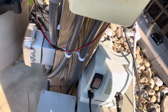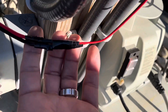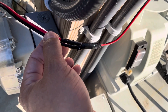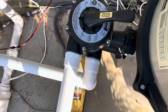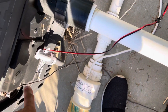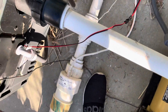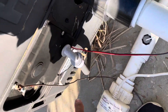One thing I did have to do is extend both of these cables. I've got a patch here — really just speaker wire. I cut it and added maybe about another four feet of speaker wire. I used 14-gauge, which really shouldn't matter if you twist it in there properly, then terminated it and used the original cable to go back into the box. It's a little messy — I might put this in a conduit longer term to protect it from the rain, but this is a rough install just to show that everything is working.